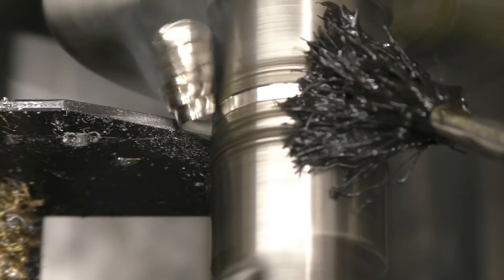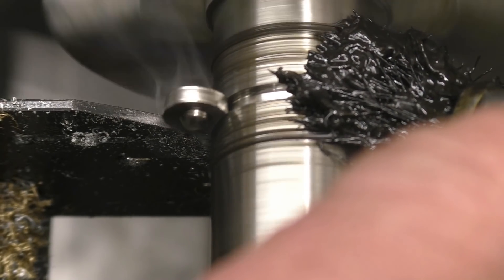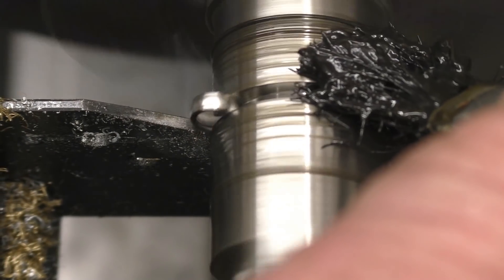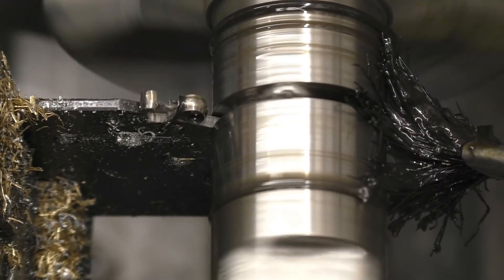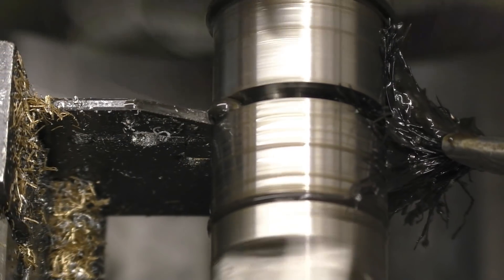This is running at 130rpm — we'll give it a try. And that is cutting nicely, that's a bit of nice material, at least as far as machining goes. Very nice indeed. It's obviously no use for a critical job because I've got no idea what grade it is, but for a little hobby gas turbine it'll be fine. It looks like the parting blade may have survived the machining of that part.